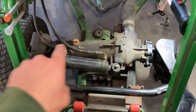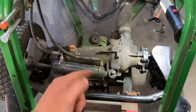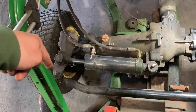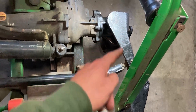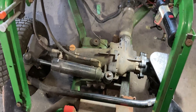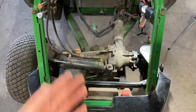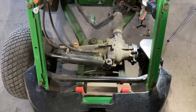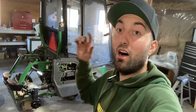Power comes in from the front transmission, goes back into the differential, which distributes power left to the left wheel and right to the right wheel — but only when the drive mechanism is engaged in four-wheel drive. The steering mechanism is this steering cylinder right here. If you choose to go left or right, the cylinder will either go in or out. That's hooked up to the steering linkage on the left and also to the right via this tie rod, so you'll have steering on both wheels — pretty much like a forklift. Now I can add brand new oil into the right side of this rear axle, mount the tire, and drop the machine back onto the ground.